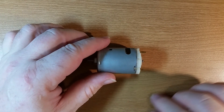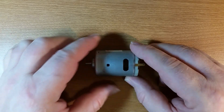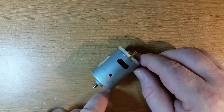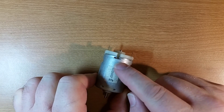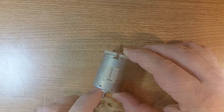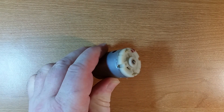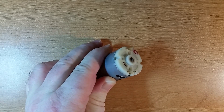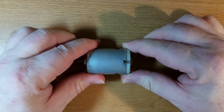I'm going to show you how that works. Let's zoom in on a motor and I'll take it apart and show you all the pieces inside. I've already done some work on this motor — you can see right here I ground off the tabs that hold it together. The construction is pretty typical: it has a stamped steel can and a nylon backplate that's held onto the can with little tabs that fold over.